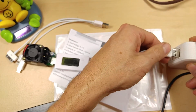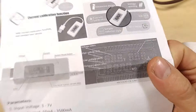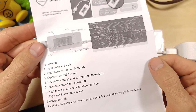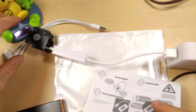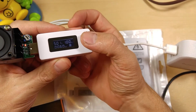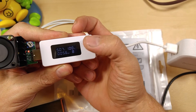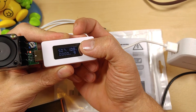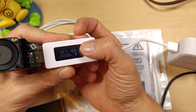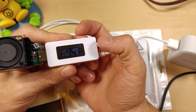Let's get into the button configuration. The instructions don't really give you all the information you need — in fact they don't even go over button pressing at all. I actually had to email the manufacturer to get that information. Basically you've got one button. Double-clicking puts you into memory slot change mode. Pressing the button once will advance to the next memory slot. Pressing it twice again exits memory slot mode and it goes back to normal, counting up on the milliamp hours again.